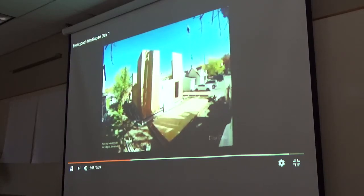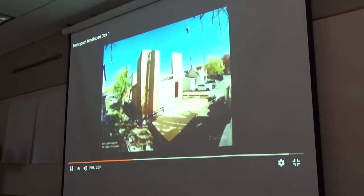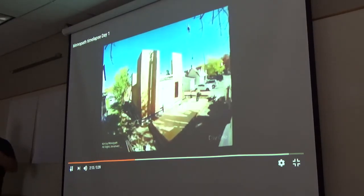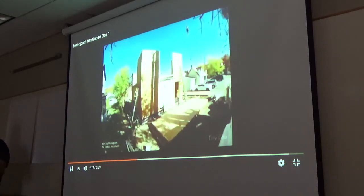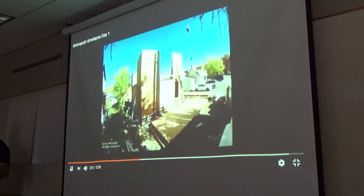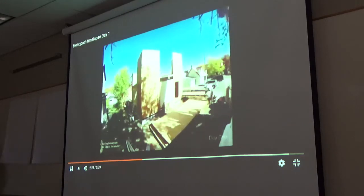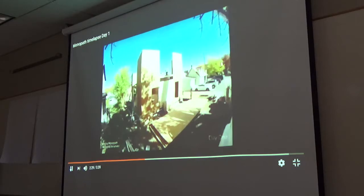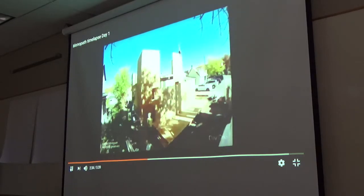The interior panels, the front and the back, are full panels, but the sides are not full panels. So you have multiple panels to get in there, and you typically fill them all in, and then the last remaining panel that you put in, you do a quick check. If you're off, that's where you make it up, or if you need 1/8 of an inch there, that's where you can make it up. But generally, the rest of it is pretty close. If you cut them 1/8 of an inch short, it's not that big of a deal. As a practice, if that's what you want to do, there's nothing wrong with doing that.